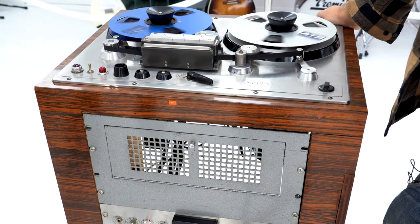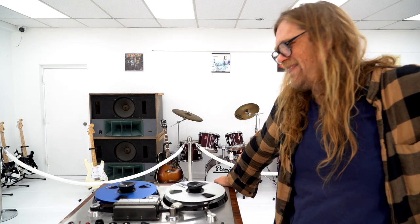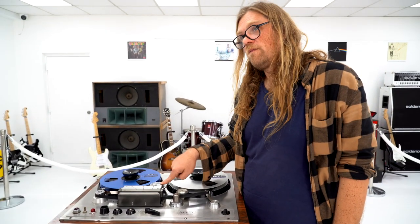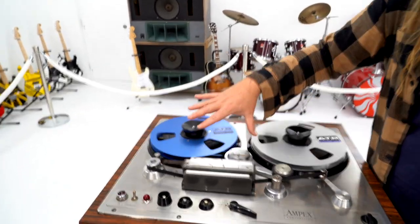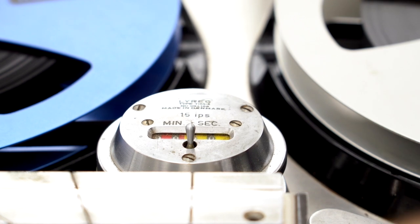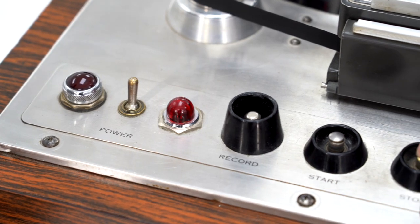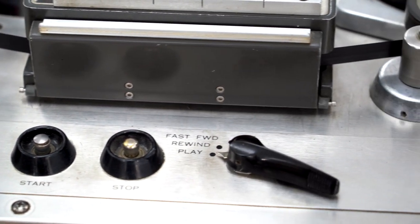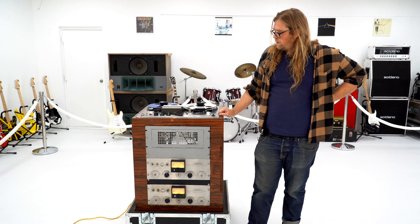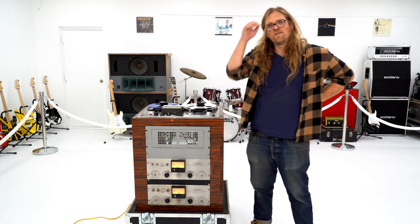The beauty of this machine is that you get that Motown glow but it works like a real tape machine — it's not a curio, it's not an antique that doesn't function. One of the original mods is a counter which slightly modifies the tape path to make the machine more stable at 30 ips — a cool feature none of these Ampexes have. I had it fully restored; Ian at Love Magnet went all the way through it. Everything's good to go, it's turnkey. It's all the euphonic benefits of the 351 electronics with the ease of maintenance of a 300 series transport, and it works in the modern studio context — you could send this to a mastering engineer who can deal with it instead of having to deal with 7.5 ips.